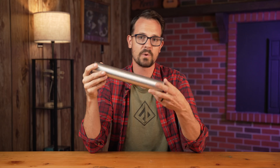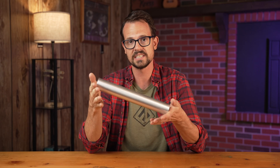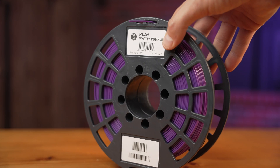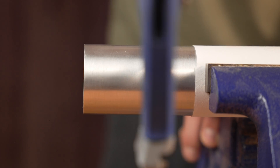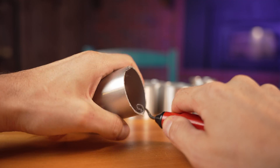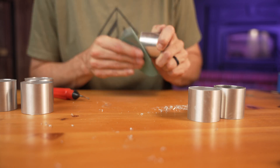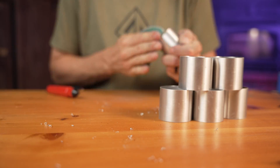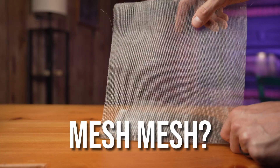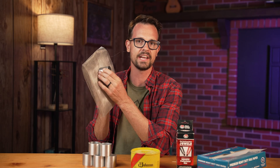To get an aluminum cylinder, by far the easiest way is to use an aluminum air intake. They come in all sorts of different diameters — I'll have a link in the description where you can pick these up for relatively cheap. I really like the 51 millimeter because it fits in all the filament spools I've ever had. After cutting the tube to 45 millimeters, I used a deburring tool to clean out the inside, and then 400 grit sandpaper to clean the outside and roughly smooth out the faces.